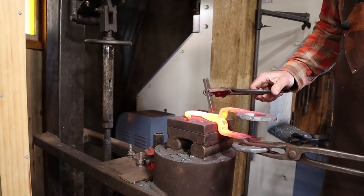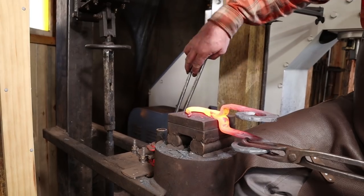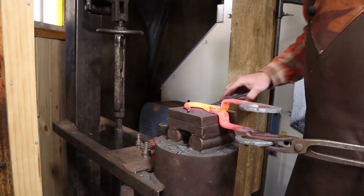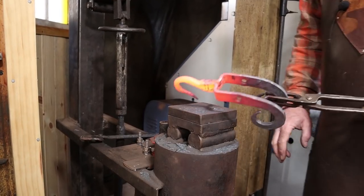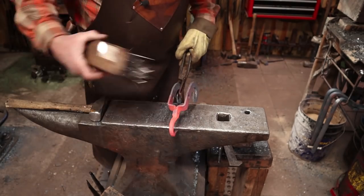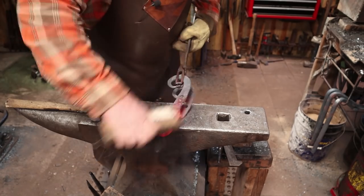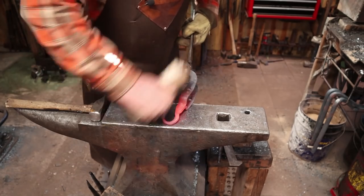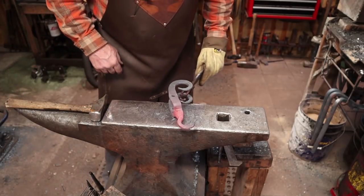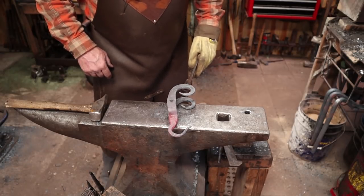Somebody's thinking — what about your touch mark? Okay, we'll put the touch mark on there. A lot of times with quick things like this I just don't worry about it, especially if it's just going to hang on the shop and not go out to a customer. I'll put some wax on it, then I'll run a drill bit through those holes and make sure they're still three-eighths diameter holes. Then maybe we'll go hang it up.